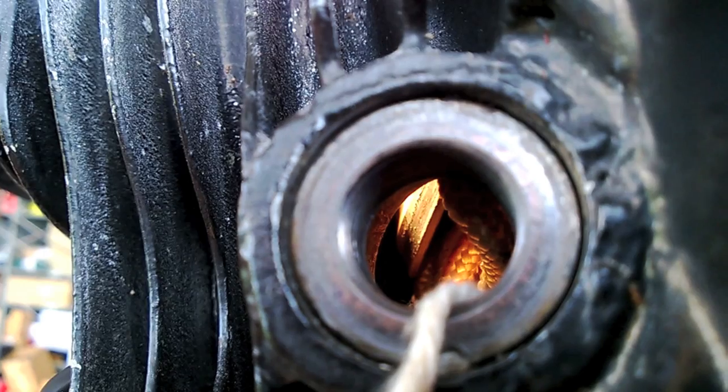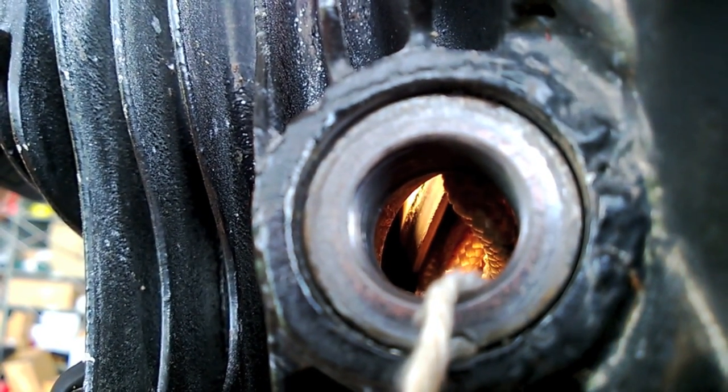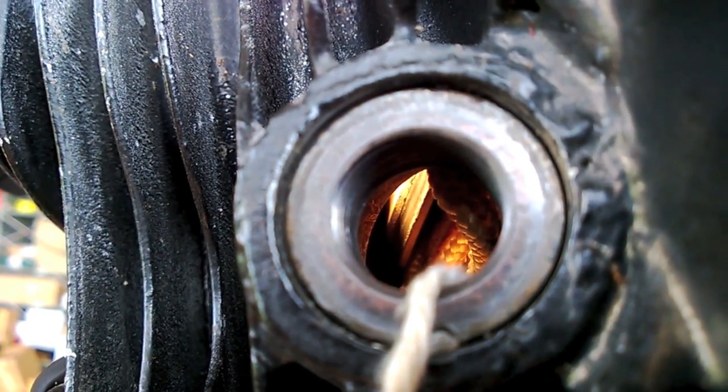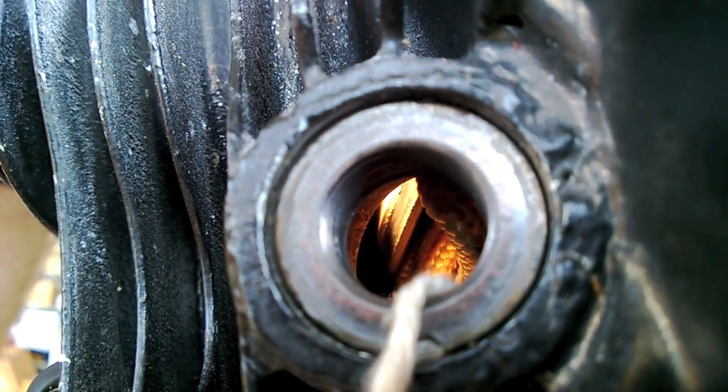I'm turning the valve slowly so you can see it in there, but by putting light down through the exhaust stack, exhaust port, we can see the valve moving in there, and see all the way around the valve now. It looks really quite good. There's no pitted area. I think we can lap this and be successful.